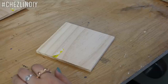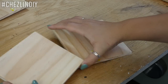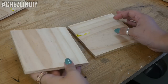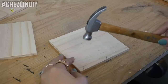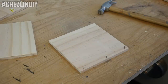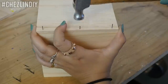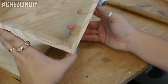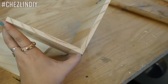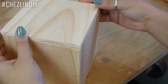Initially I didn't glue the pieces together — I was trying to get away without using glue, but I had to go back and glue it all up in the end, mostly because I was using short tack nails which are technically only supposed to hold wood together while the glue dries. Along one of the five by five inch pieces, hammer three nails along the end you want to be the bottom, but not all the way through. Take the five by four and three fourths inch piece, apply glue to one of the five inch edges, line it up, and hammer the nails to attach. Make sure you're hammering the pieces correctly — I accidentally switched them so the edges weren't the same, but I noticed quickly and fixed it. Apply glue along these two edges and place the other five by five inch piece on top and nail together.